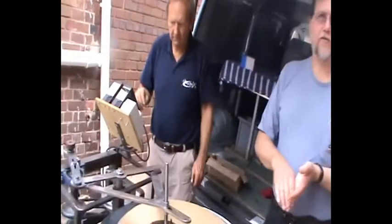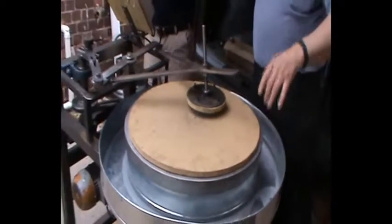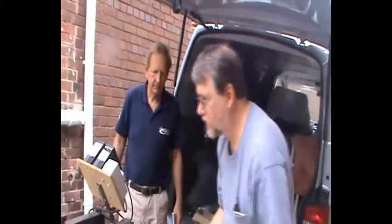This is a combination of input from a lot of people. The basic principle of a single swing arm like this and a horizontal table is the Elgin style of machine. If you were to articulate this so that it could move as well as sweeping, that would be like the Zeiss machine. There are also the Draper and Hindle machines which are rather complicated. Determining what path it's tracing is already complicated enough, and as you add more adjustable elements it becomes almost impossible to understand what the machine is actually doing. The Elgin has proved to be the benchmark — in industry it is widely deployed and gets excellent results. So we decided to start with the Elgin machine.